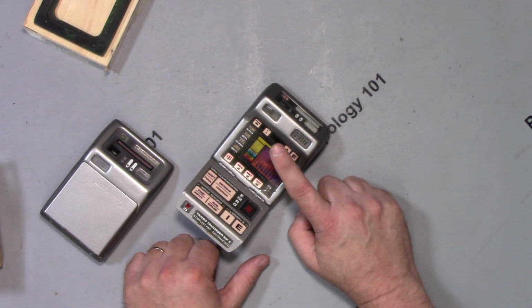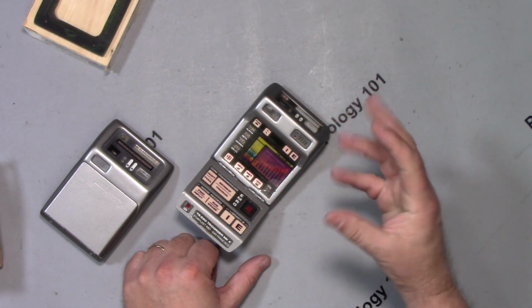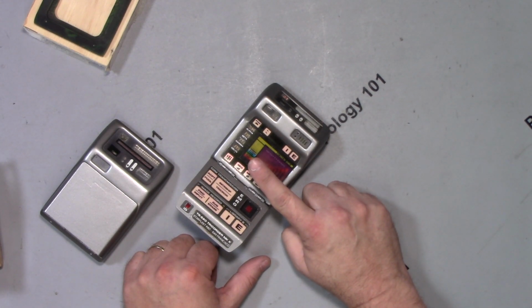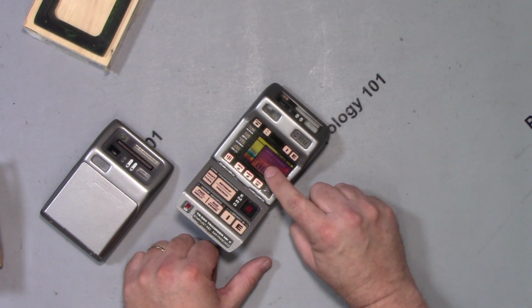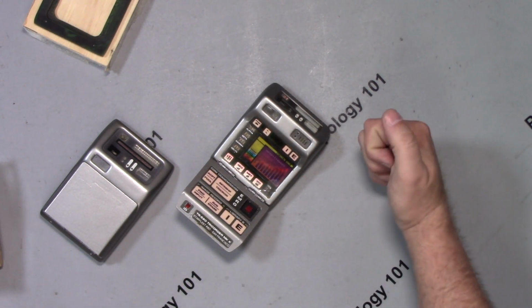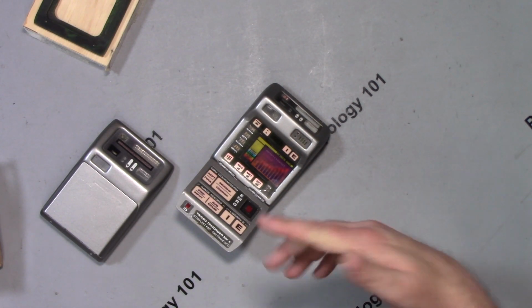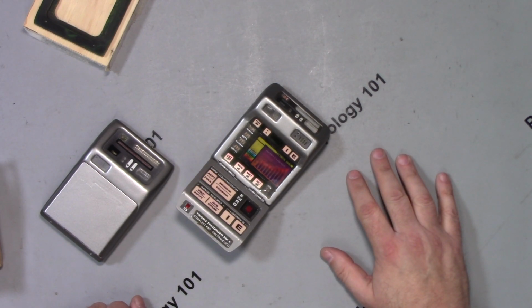This unit on constant power, meaning that every single LED is on or flashing, we ended up having this particular prototype burn constantly on for about 4.5 hours, just sitting there with a timer next to it. When we told that to Joe Longo, he was pretty ecstatic that he wasn't going to have to change batteries every 30 minutes during a production.